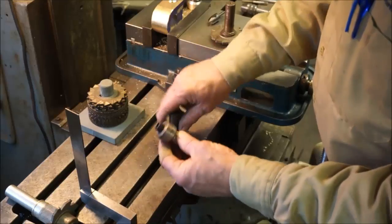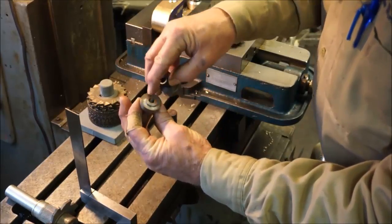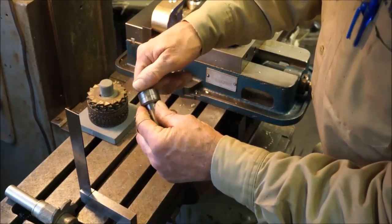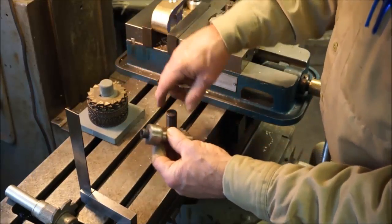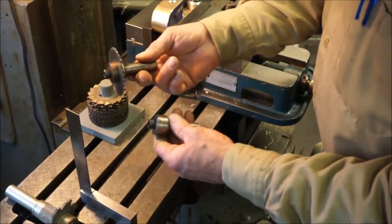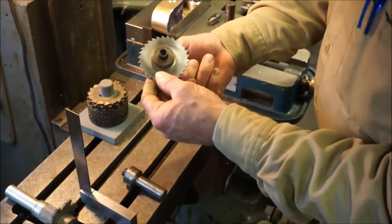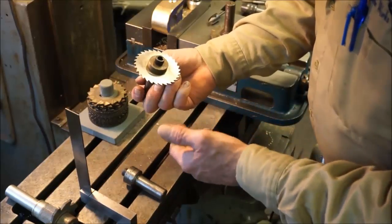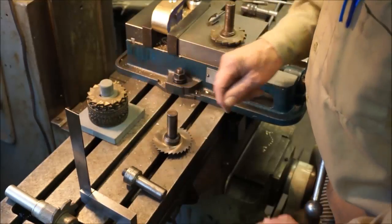This here is the slitting saw for 3/4 inch diameter, and that's that diameter right there, the inner circle, and then you have the draw bolt here, and that sandwiches it. This Allen's actually a little short for this one here, but I got it set in here because I believe I interchanged to either or from this side here. This one here has got a 3-inch diameter, 1/16 thickness, 1 inch bore size. So that's what's on this one here.